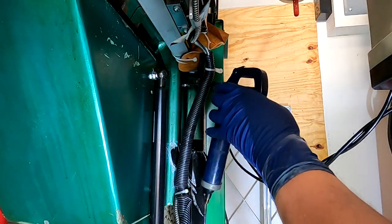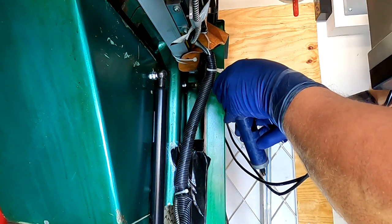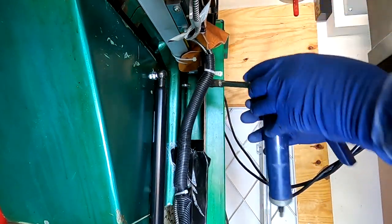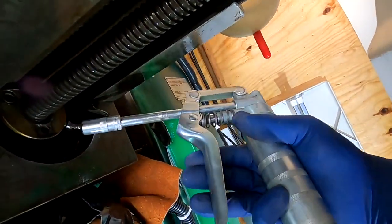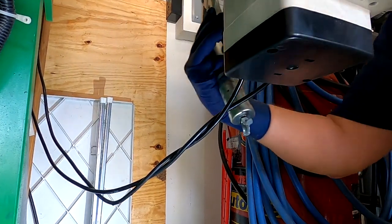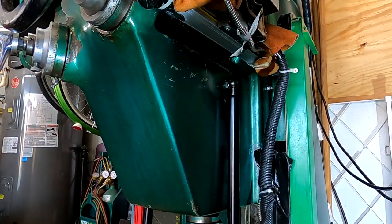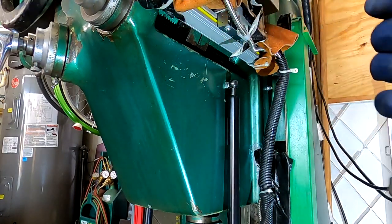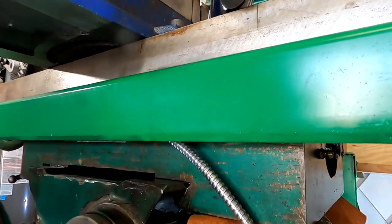On this side, we're going to get the oil in right here — that one's hidden a little bit. I put a 45-degree fitting on it so I could access it easier with the DRO in there. You can hear that oil pumping in there real nice. Then we'll switch the oil gun for a grease gun. We'll come up here, get these grease fittings, just a couple of pumps — one here and then there's one on the backside here, again just a couple of pumps. Then pumped some oil into here. This will be on our Y-axis way. She's pumping in there real nice — I can see it pumping out right there.